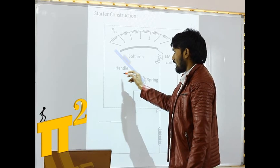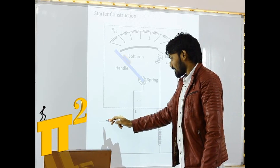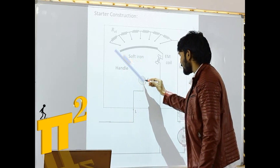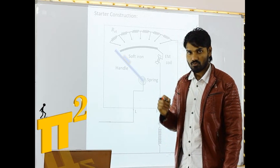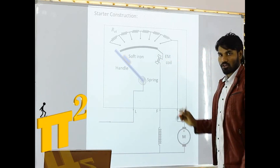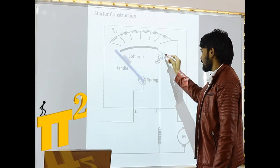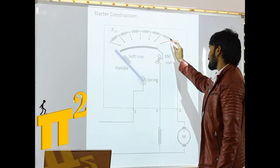The handle is made up of any insulating material. One thing to be noticed here is that the line connection is going this way — it seems like the line connection is terminated here, but actually this line connection is going beneath this handle; the connection is still going further. This connection is behind that handle — that is a very important thing to notice. Another component is the electromagnetic relay or electromagnetic coil, which works like any other electromagnetic coil — if current is flowing through it, there will be some flux around it. This is a starting resistance, which is connected in series to the armature.